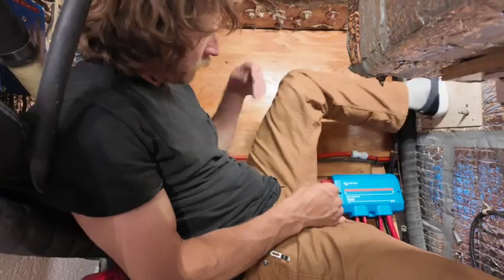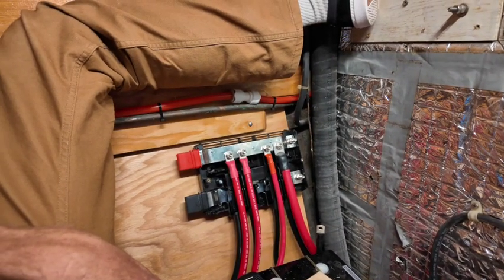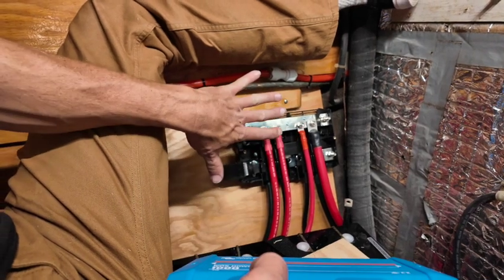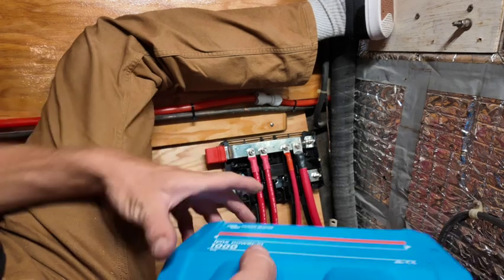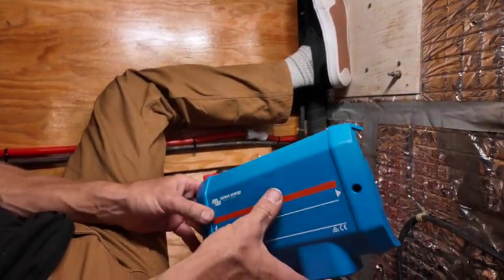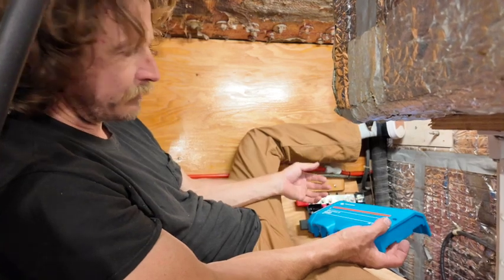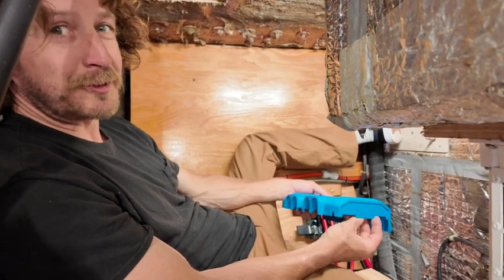Like I said, pulling the bolt out of the negative bus bar's grounding terminal should be fine — if it is necessary I can tie it to a ground off of the next panel. Looking pretty good. I haven't connected the batteries yet; I want to get the dead side connected first. In electrical work, don't do the hot side first — do the load side first, then connect the lines from the battery. I don't have the Max fuses yet to connect the whole system, but I figured tying all the batteries together first should equalize them so they're all at the same voltage when we start.